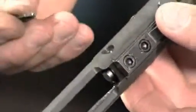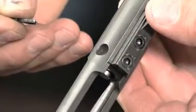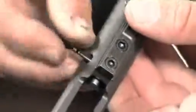The firing pin retains the cam pin. Install the firing pin retainer pin from the left hand side of the carrier so it sits flush with the side of the carrier. You are now ready to start the process of checking the headspace. At the end of the checking the headspace segment, we will demonstrate how to reinstall the ejector.